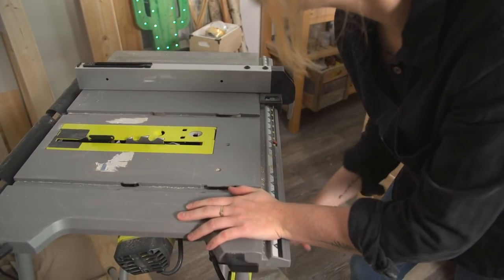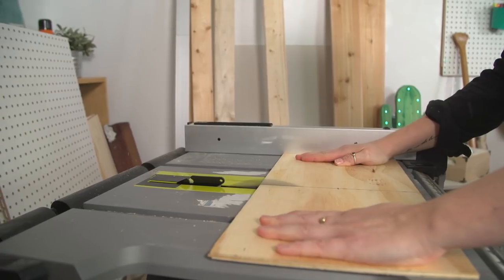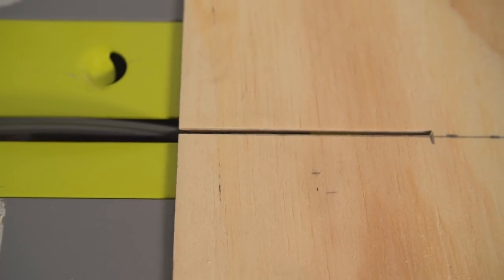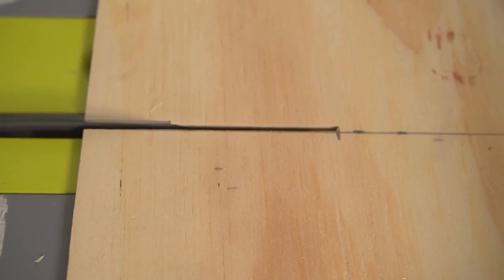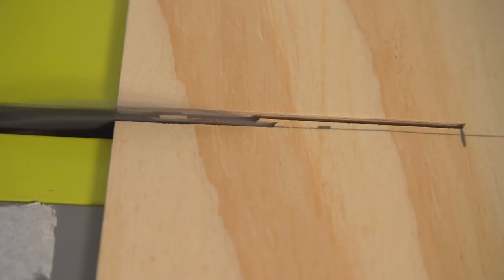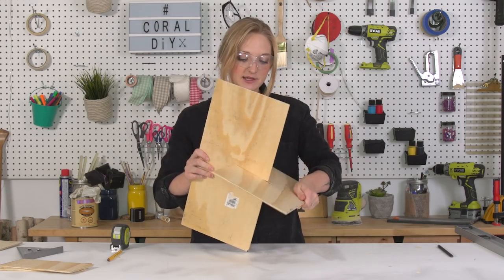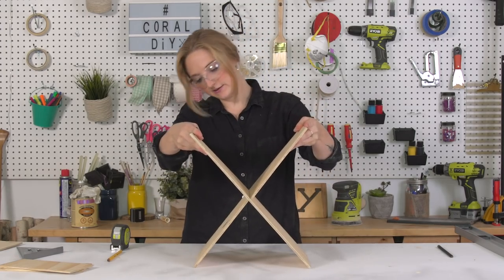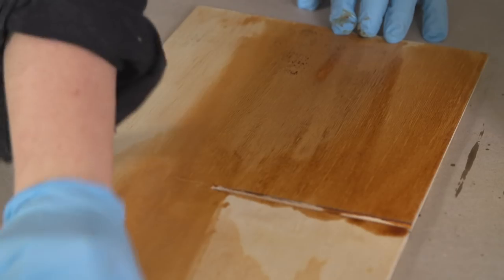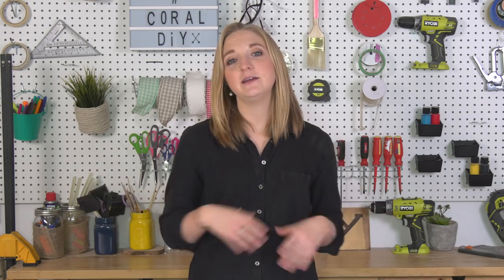I'm adjusting my table saw to 20 degrees, and I'm lining up my saw blade so that the blade cuts through the middle of the line to your marked center point. Pick the top or bottom of your cut line, and run the blade through one more time. Whichever side you pick, make sure you do the same on the second board. Repeat this step for the second board. Now I should be able to take the two pieces, slide them in together like such, and we have an X! I've stained my X the same color as my boards to give it a nice look, but you could paint this, leave it natural — do what you like, and make it your own.